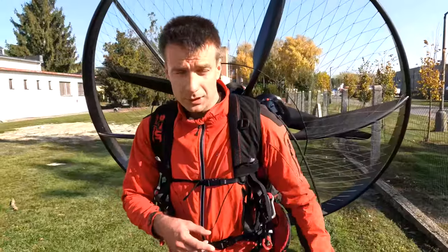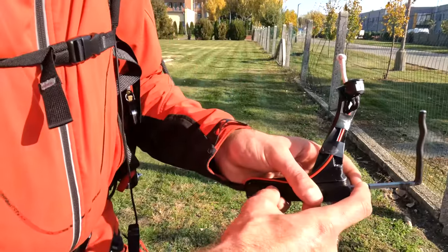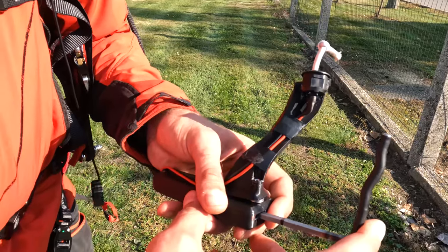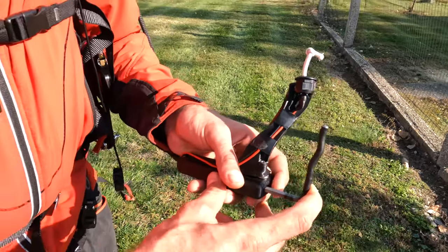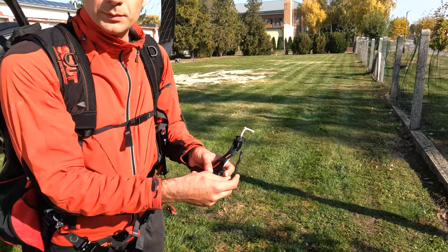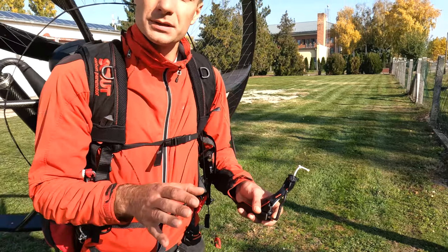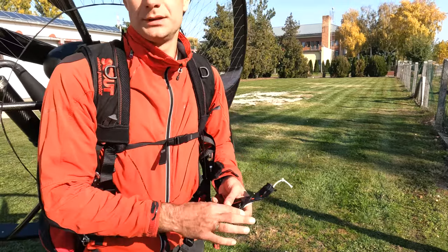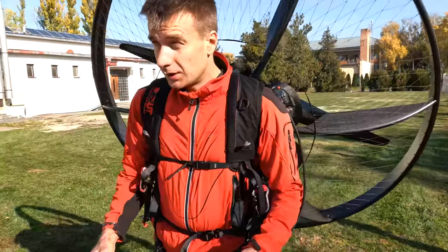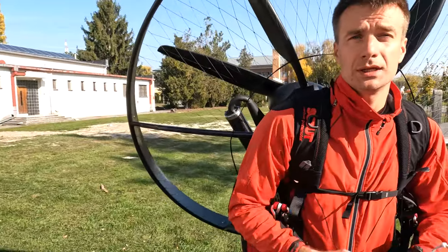Now we have the mark, so let's measure it. Actually, look where it is. It is in the first third. I told you so. I was here, around here, in 1/3 you get into the mid range. Another third will get you to 8,000, and the last third, 600 RPM from 8,000 to 8,600, is hardly noticeable in the sound and in the thrust anymore.